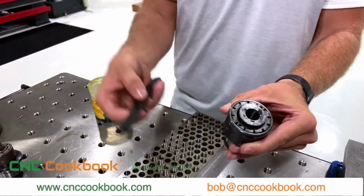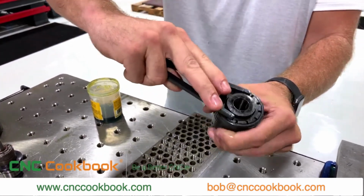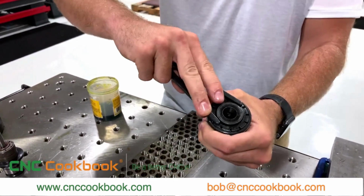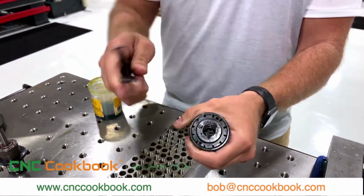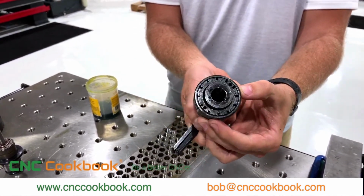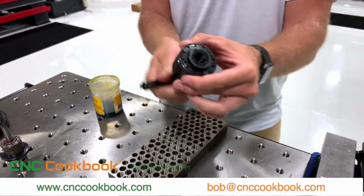And there's a small little spanner wrench that we'll put in the tap holder. We'll turn that to the right to tighten it. We'll make the adjustment to the left if we're going into plastics or aluminum. And then we use that retaining ring around the collet to lock that setting in. That way we're going to get the consistency in the material every single time.